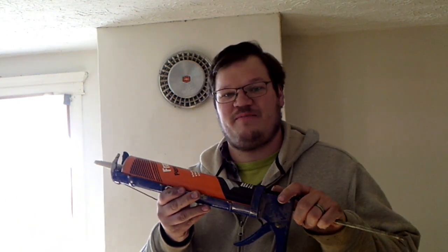Now this is a step that many people overlook — make sure you glue down your subflooring, otherwise you're prone to squeaks. It doesn't have to be done and it's not code where I'm at, but it's highly recommended. Any construction adhesive will work. I have a big tube of panel adhesive left over from another job; I'm going to finish it up and then switch to a subfloor adhesive. It doesn't have to be subfloor adhesive — any construction adhesive will do. It's better than nothing.